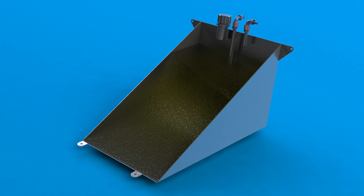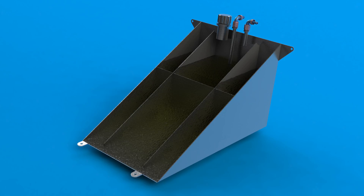There are several solutions to this. The best seem to be specialist foams which reduce the sloshing and contain the fuel in the event that the tank gets penetrated in an accident. This is required in some higher racing categories, however this is not the case in Formula V. For me, a more traditional baffle solution suited me quite well, as the baffles would also provide the internal bracing to the fuel tank, which would allow it to be used as the driver's backrest.